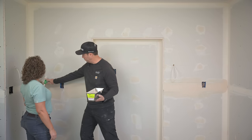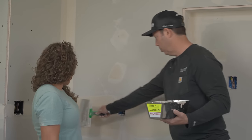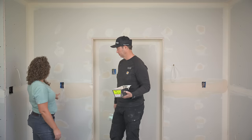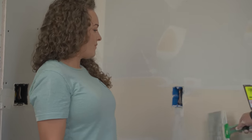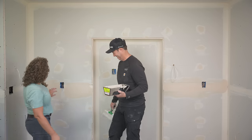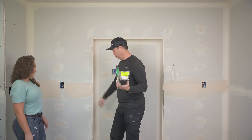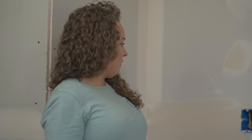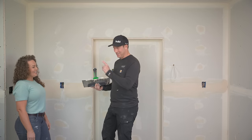I also feel like I'm putting more pressure on the outside of the knife when I scrape the top, outside of the knife when I scrape the bottom, and then I'm more flat coming across. Is that true? Yeah, that's true. Like when I do this, I would cut this even farther. And your mud isn't quite centered — you want to have your mud centered here, not so low. So you want to be covering the flat. It only took me 30 minutes to get this wall done — that's not bad, right? I think you're going to lose money because you'll have to come back and sand this so much. You just cost yourself probably like 20 bucks. So how about you show me how I should be doing it on this seam over here? Absolutely.